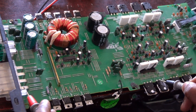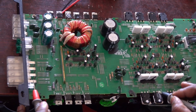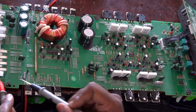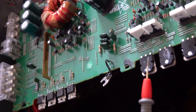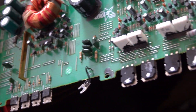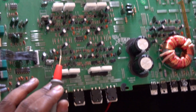There's a bridge - left right left right. For the left channel there are two transistors on this side and two on the other side connected to the innermost side of the channel. The first two transistors are connected to one output and the other two transistors are connected to the other output. Then for the right side - the two left and the two right are interconnected similarly.